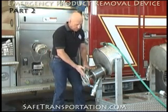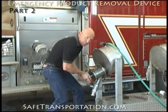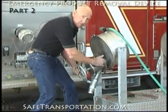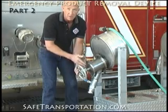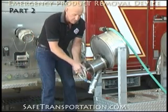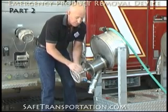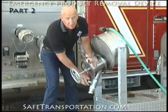When we get ready to take this off, make sure you don't make a few big mistakes. One mistake is standing directly in front of this valve and pressing up against it, because once you try to open it, the clean-out cap literally wants to come toward you — pressing in on it makes it feel cross-threaded, and if you're too close to the Viton gasket, you may cut into it. Instead, stand to the side to keep yourself out of the way of any potentially large leaks, especially since it's a pressure vessel. When you're ready to open it with your unloading process in line, turn it to the left, feel the cap loosening up, and finally the cap comes off and the product pushes the cap out of your way. At that point, the ball valve down here can be opened and the pumping process can start.